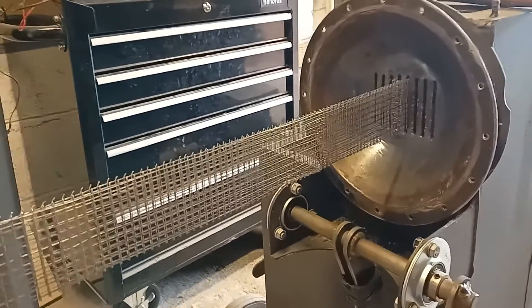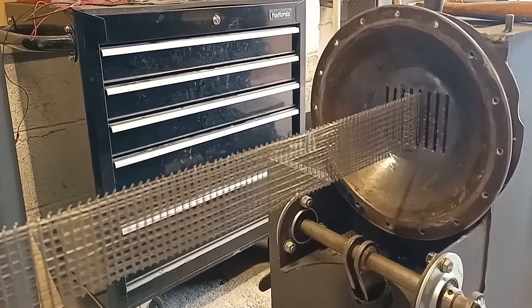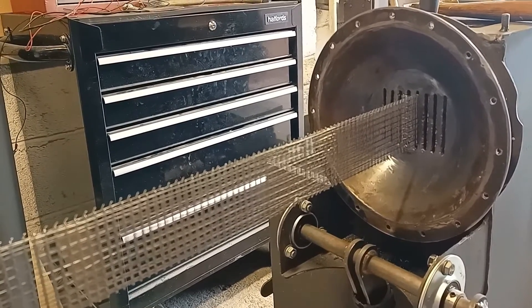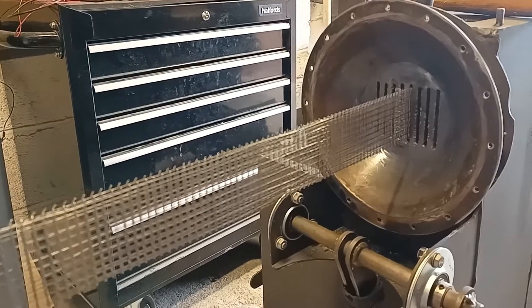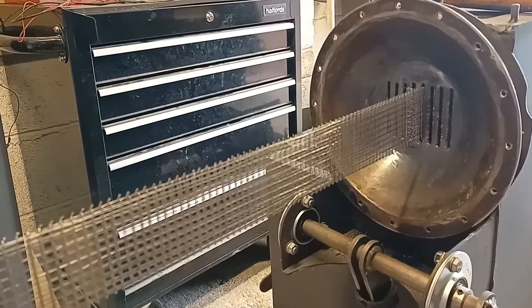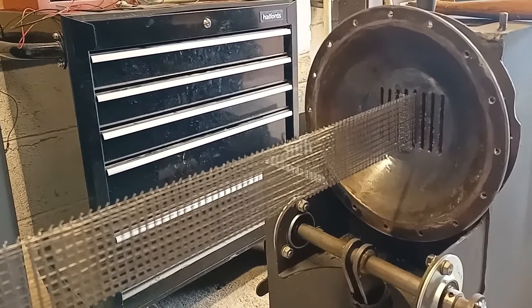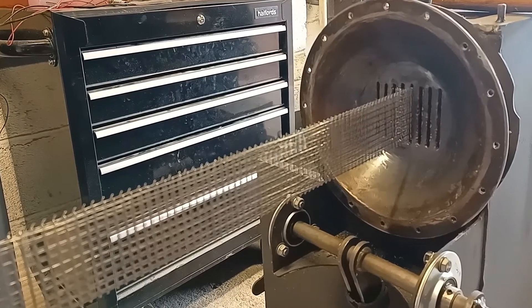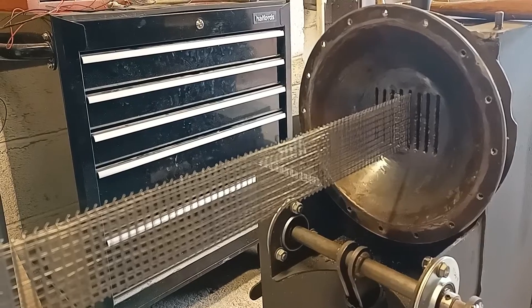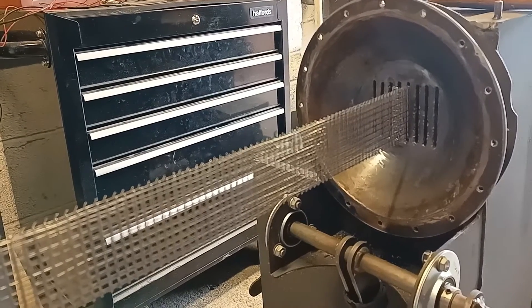So this is being inserted into the heat exchangers — somebody gave me this idea, so thank you very much for that. There are three reasons: to cut down on dead space, create a more regenerative effect, and by having more surface area available, also create more turbulent air as it passes through the heat exchangers. This will help with the conduction of heat into the air and extraction of heat from the air as well.